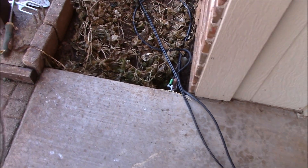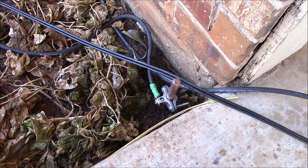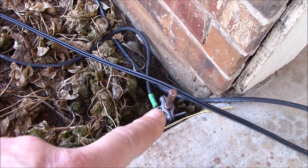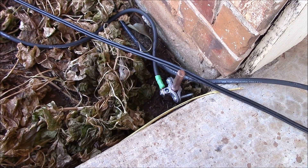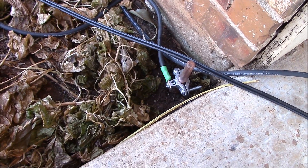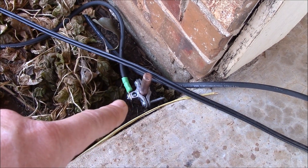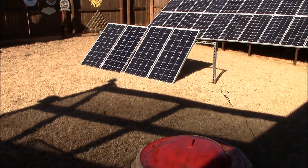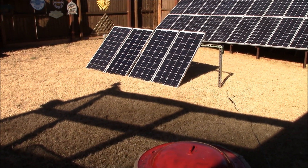Safety first — always do grounds. Down here next to the porch, this is probably one of the wettest areas of the house — very low spot. I had about a four-foot section of grounding rod and banged it down. Eight foot is ideal, but if I don't have good grounds at four feet in this wet of soil I'd be very surprised. The other end of the grounding cable is connected with a grounding rod clamp right there — works real good.